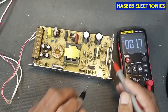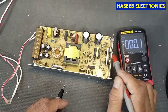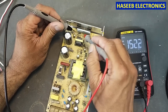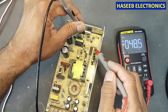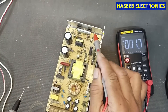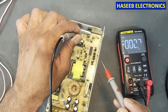There is no voltage at those pins, which means the problem is in the high-power area — it is not taking the initial startup from these MOSFETs. We then check the voltage on these two diodes. One diode shows no voltage; the other shows 336 volts. That means there is a problem in the MOSFETs and surrounding components in this area — it must be balanced but is not turning on.